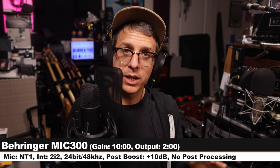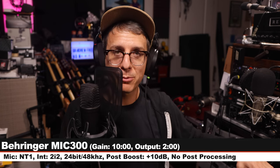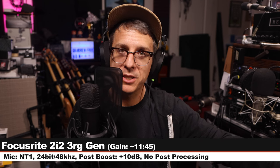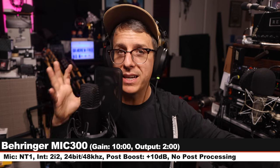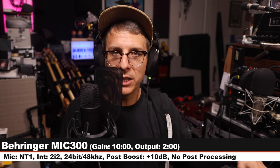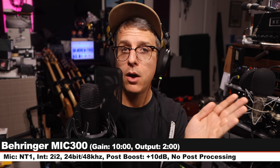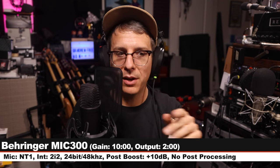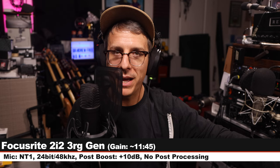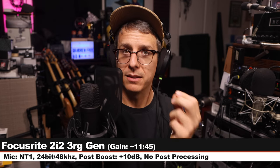Now I want to include a quick comparison between the MIC300 Pre and the inbuilt preamps on a Focusrite 2i2 3rd Gen. So I am running an NT1 into a microphone splitter. On the MIC300, I have my gain set at 10 o'clock. Output is set at 2 o'clock, and that runs line level into the Focusrite. On the Focusrite Mic Pre, my gain is set at 11:30.